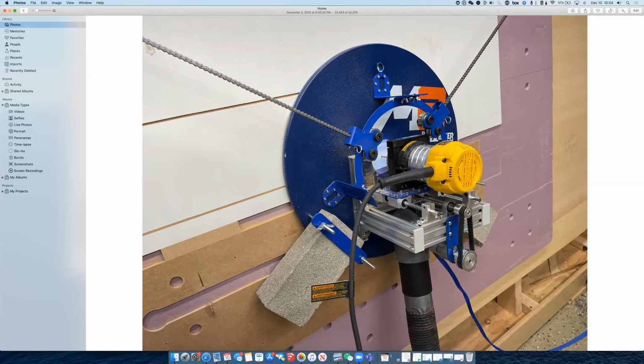And then obviously with the M2, now that we have the Z-axis, there's not a lot of room to place anything in the center portion of the sled anyway. But yeah, some users will drill a hole in that side piece of aluminum of the Z-axis, and then run a bolt through there and hang, I think it's like 2.5 pound barbell weights on there, and then be fine. It's all in your desire to push the kit further into your use case. Another thing that people have done too is adding almost like a skirt to the outer boundaries of their surface so that they don't run into that overhang scenario that you spoke of.